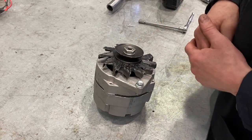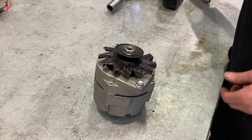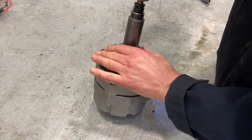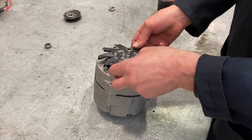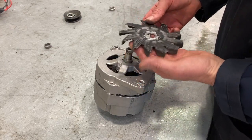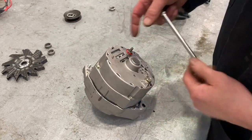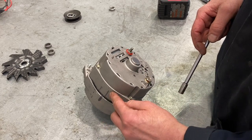We're going to start by taking the front pulley nut off. We're going to use an impact for the disassembly and tighten it later with the ratchet. We have a little spacer that goes on top of the fan here — it actually bats the back dirt away, so it kind of acts like a centrifugal filter in some ways. Back housing on there, and we've got a mark indicating the alignment of the front housing from the back housing.